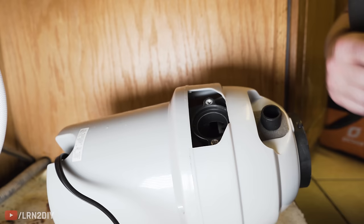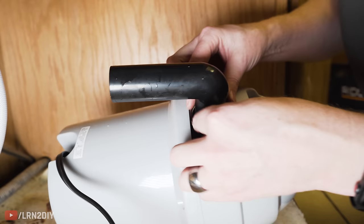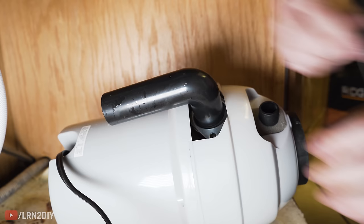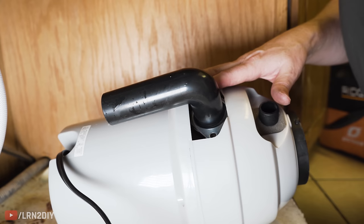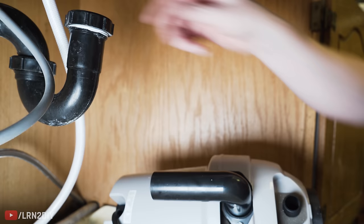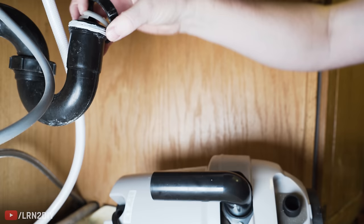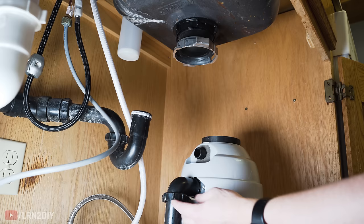Another preparation step: take the drain that came with it, put the little rubber gasket in the right place, and make sure the metal bracket is on there. Slide everything in, put it in place, and attach it with the two screws. It's a lot easier to do this now while it's not mounted than to try to reach around it once it's mounted. I'm also going to take the ring and the nylon ring that goes with it and slide that on to make it easier when I'm ready to put it on. With everything prepped on the drain pipes and on the disposal, I'm ready to get started.